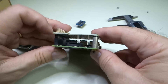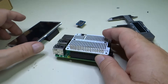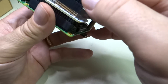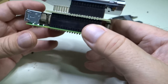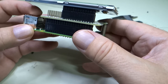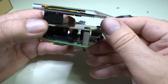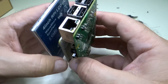We'll tighten it down later, but now you can see we have a very nice, reliable, and stable condition. With the stacking header, you can basically pile more stuff on, and that's done by plugging on just like this. This display was meant for the Pi version A, but the first 26 pins are equivalent, so you just plug it on like that. Now we have our breadboard area and a display — makes it very useful, and it still fits in the jar.